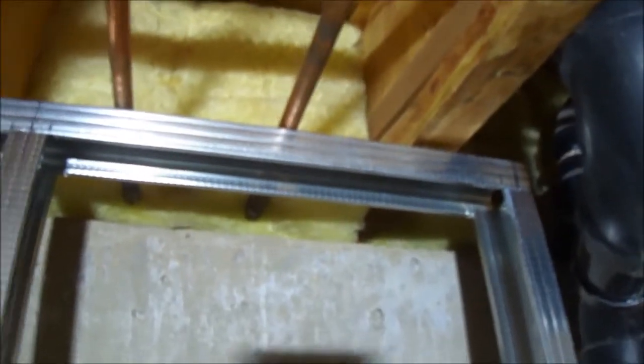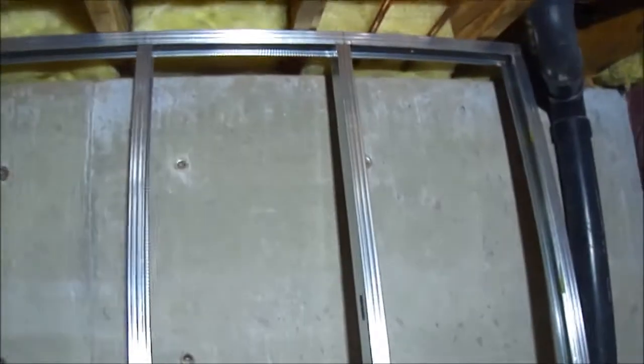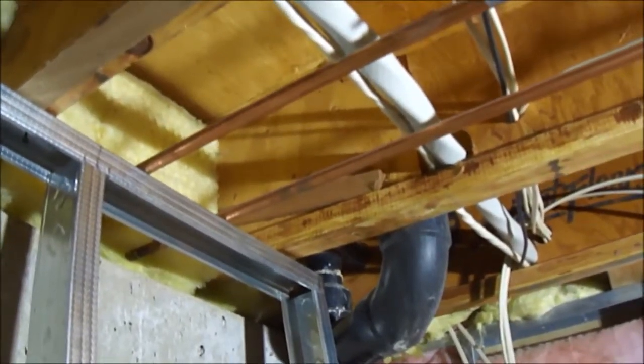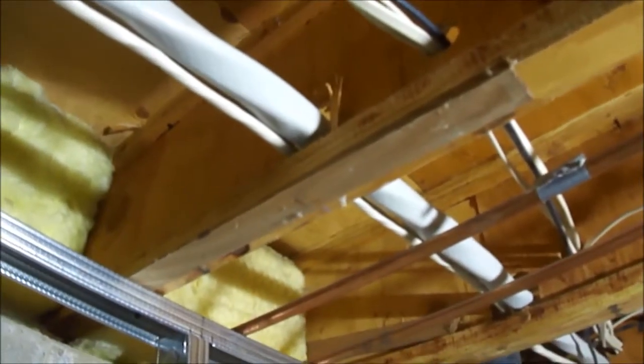Also made the vertical studs the shortest length that would fit between the top and bottom. And as you can see, there's a gap on the one side, so we're not the same height all the way across this wall. So what you do is make all your studs one length, the shortest length that fits, and then you shim that down. Here's an example where we shimmed it. There's the shim. But after I get it all plumb and square, then I'll do the finish shimming there.